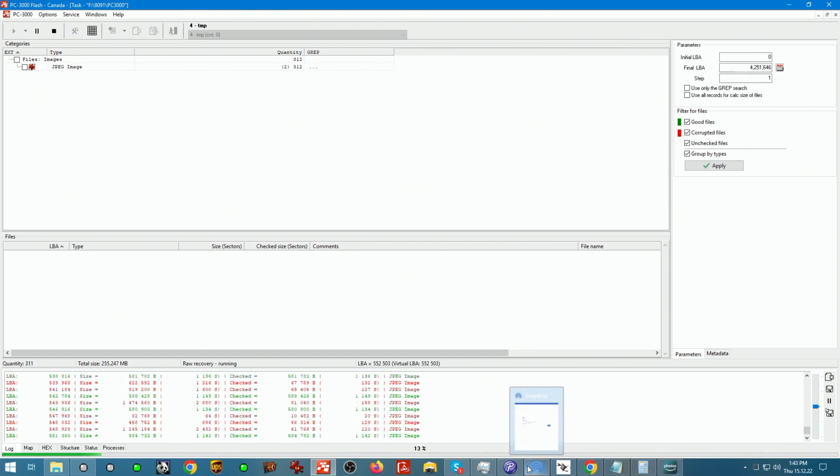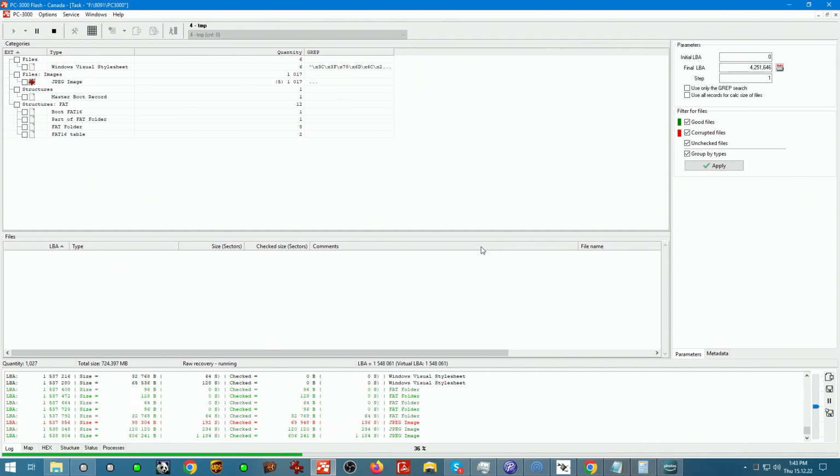Keep in mind that memory cards, especially when you're working on recovering a card that was used in the camera, they don't always have filled up capacity with working files in them. So some cards will only be filled up to 25%. But that doesn't mean that the card was not extended and used to its entire space before. So if it has been, old files will still remain on the card. And that's maybe something what we're seeing here as red highlighted files. If the files had been previously taken by this camera, but then the camera was formatted, and on fresh format new pictures were taken, these new pictures most likely are appearing as green.